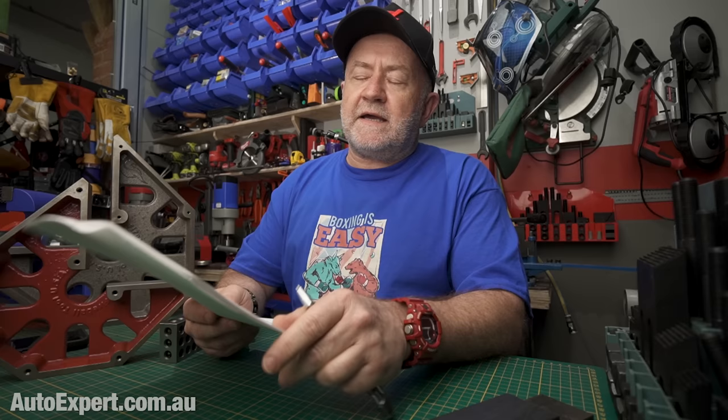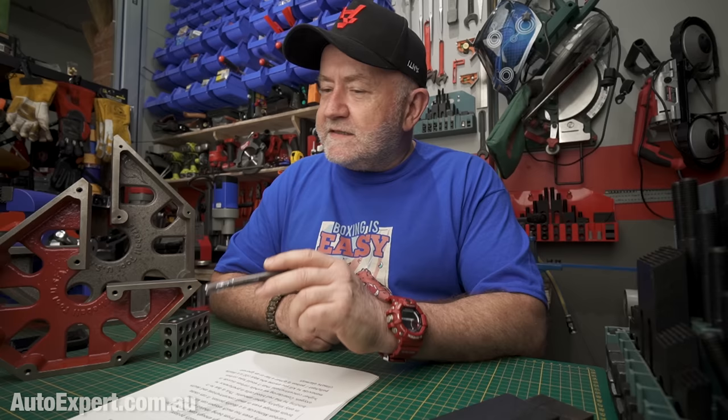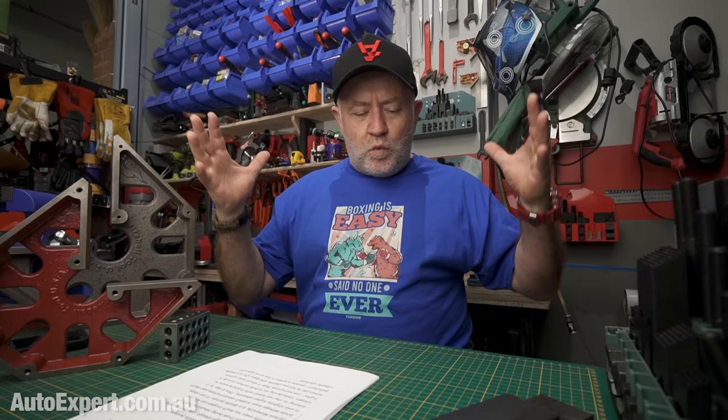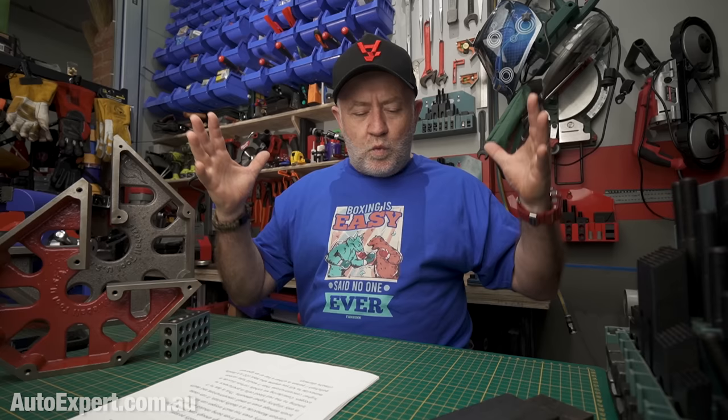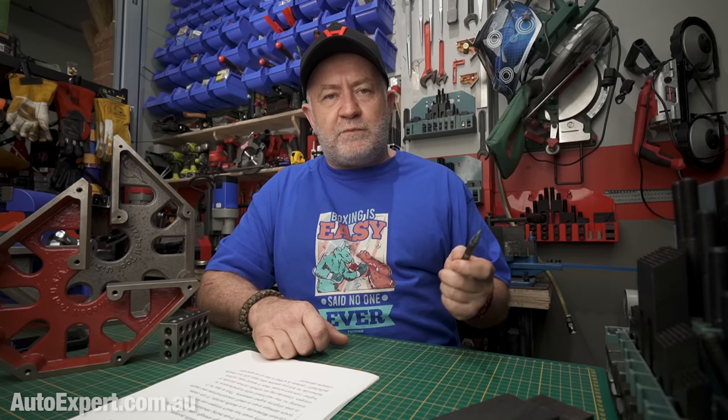Here's what they do: if you're in an oil refinery and you've got to weld the inside of a tank that normally contains petrol, that's a pretty interesting assignment because it's very hard to get rid of the explosive vapour. So what they typically do in potentially explosive environments where you've got to weld is they pump nitrogen gas into the environment — they displace everything with nitrogen gas. And of course, nitrogen is mainly what you're breathing now. The air you breathe is 78% nitrogen. And the reason they do that is because nitrogen is not toxic, but it displaces the oxygen. And therefore, if there is any latent vapour inside the tank, it can't burn when exposed to a source of ignition, i.e. a welding spark. Nitrogen is chosen because it is not toxic.